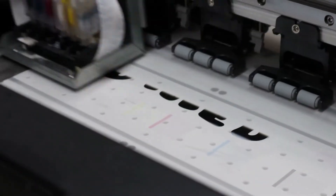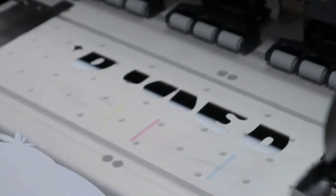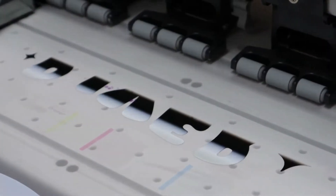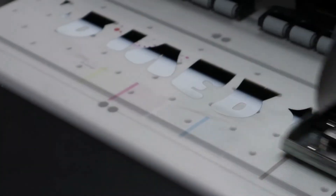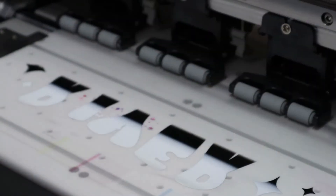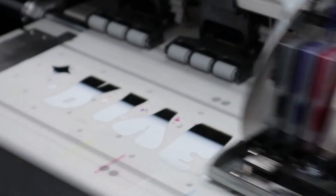As we're printing this full image, you're going to run an image that's got a good range of color. As you are printing a DTF transfer, you want to make sure your colors are coming in with no streaks and that your white is coming down at a good rate. With this printer, as it just begins, it starts the white a little slow — so typically we would stop here if we're ready to go. If you see quite a bit of banding in your color, you might want to do another re-clean and restart the print, just to make sure the heads are exactly where they need to be to be set for the day.